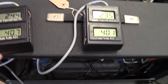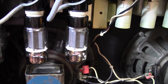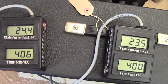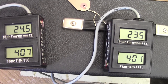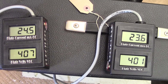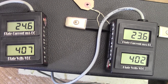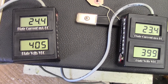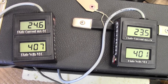I've got a couple of bias meters on the output valves — 6L6GCs — and they're running at about 400 volts, so the correct bias current is about 50 milliamps on this. I'll put up a handy link to a bias calculator for you. This is quite low, but of course we don't know where the bias pot is set, so I'm going to need to take the chassis out, get it up on the bench, and twiddle the bias pot to see what's going on.